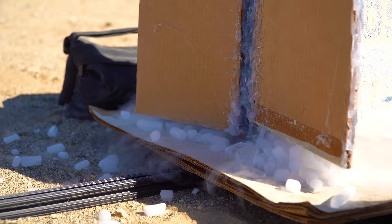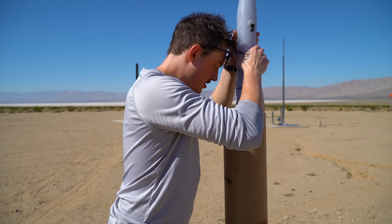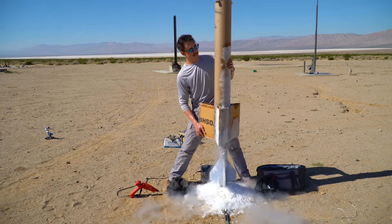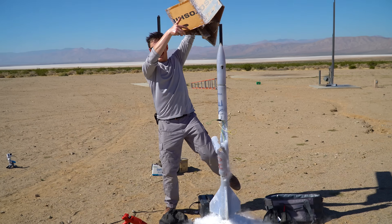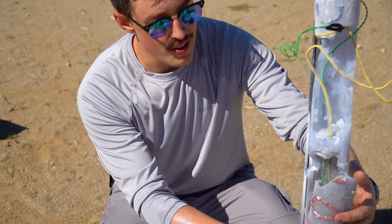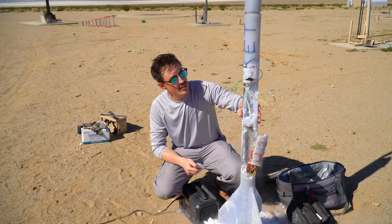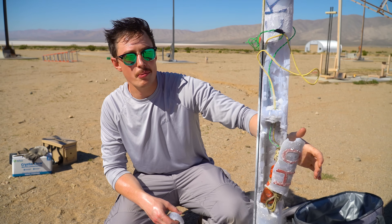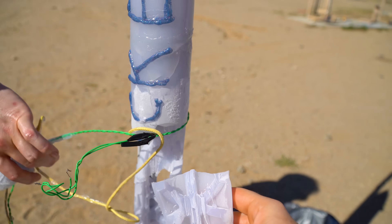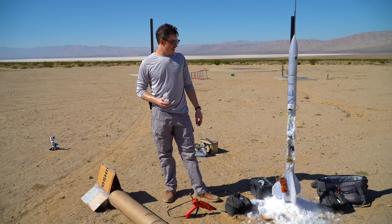During that time I moved around setting up cameras, and about 10 minutes before launch I checked on the rocket in the tube. Uh oh — oh no, it broke. It entirely fractured. The whole thing, without shaking or moving it, the whole thing came apart. Here are my parachutes — you can hear it cracking. It's like thermal stress that's just splitting it all apart. It's like these thin sections — if I hold it, it stresses the material enough that it fractures. It's just breaking apart like that. This is a much harder project than I thought it would be.